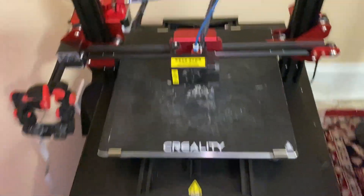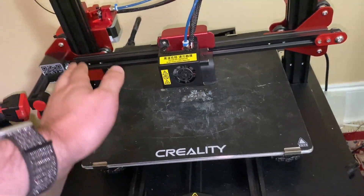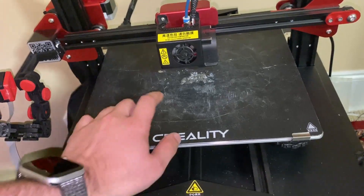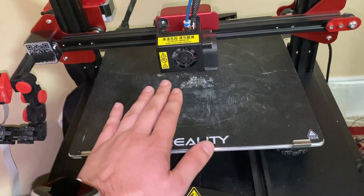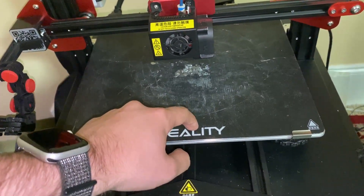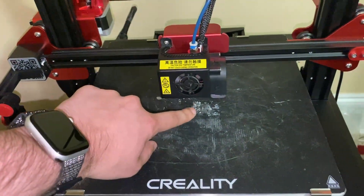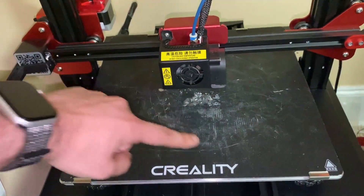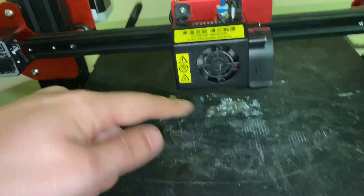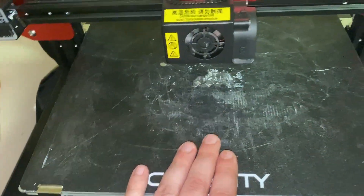So you've got a printer. First of all, you have a bed plate. My current model is called a Creality CR10S Pro version 2. You could have an Ender — it doesn't matter which brand, all of them are going to have a bed plate. Sometimes they're heated, sometimes they're not. If it's heated, what that helps with is when it prints plastic that's really heated up, it's going to stick — that's what's called bed adhesion. As this nozzle moves up higher, it's moving left and right, and the bed is moving back and forth. The plastic is building up, and if this nozzle shoves it off, your print's failed. That's why a heated bed is a nice thing to have — usually upper or higher-end printers have it.